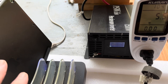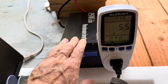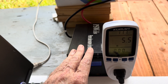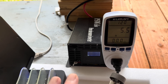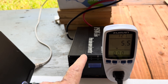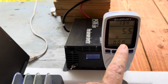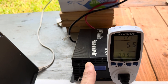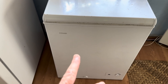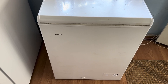This is one of the best ways to learn what your devices and equipment draw. Of course, I'm not hooking up the George Foreman grill or an air fryer to this, but the same principle applies with larger batteries and a larger inverter — you can run all of that kind of stuff as well. But if you're just getting started and you just want to dabble, get yourself a battery, an inverter, a couple of solar panels, and for sure a wattmeter. Start testing out the stuff you want to run — see what it draws, see if you have the capacity and equipment to run it. Five cubic feet of food security right there, frozen solid below zero, drawing 60 to 70 watts even at 80 degrees ambient temperature.